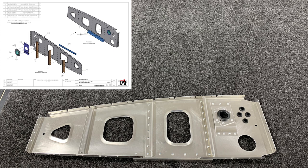On the right wing there's only a total of four grommets on the entire assembly, so you can choose to wait and see exactly where you need to place those. On this particular rib it's the bottom grommet that you'll use on the right wing. The only thing to make careful note of on this rib, as well as the next rib — rib six — is the flap torque tube assembly and the black grommet there. All the holes need to line up perfectly, and you need to take special care when deburring and preparing that mounting bracket to make sure you don't bend or tweak it. That grommet and the one on rib six need to be perfectly aligned after assembly so the flap torque tube is able to rotate freely without any binding.